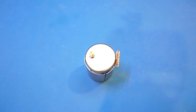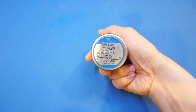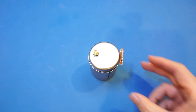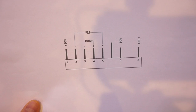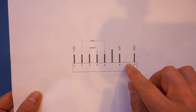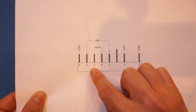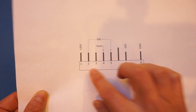Let's take a brief look at the pinout of this specific YIG oscillator. Keep in mind that YIGs from HP have a very different pinout than those from other manufacturers, so you need to be very careful. This specific YIG, part number 5086-7023, came from a frequency extension plug-in for the HP 8660C. The pinout has a ground connection, two bias rails — plus 20 volts and minus 10 volts — the main tuning coil between pins 3 and 4, and the FM coil between pins 2 and 5.